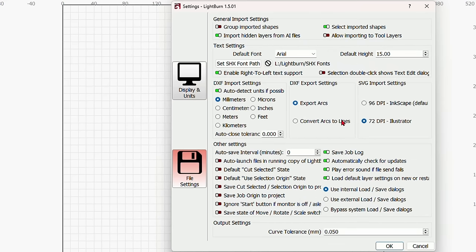So now that we've done that, let's do something different. Let's talk about current position. Let's go back to LightBurn. So now I've changed to current position and I've put this dot in the center. I always work from the center. So if you put it up here in the top right or top left corner, it's going to frame down from that corner, but I like to frame from the middle. So I will take this over here.